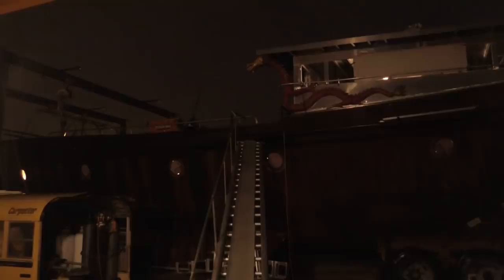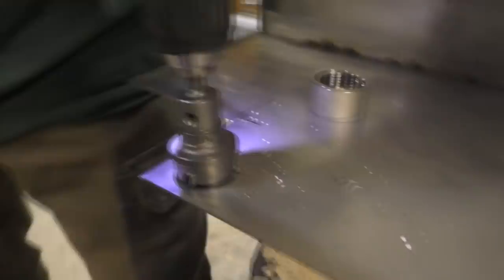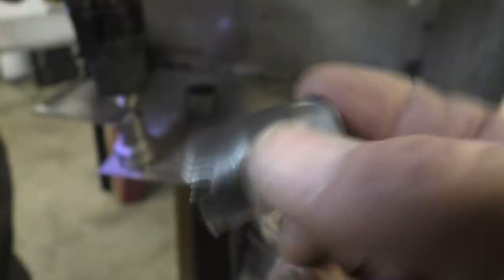I gotta give a huge thanks to Chris - it's been a wonderful learning experience. If you taught me right, we'll see - people on YouTube will let us know. He's got the amperage turned up to 170 with a kick on the foot pedal, nice hot arc, for welding on the stainless expansion tank. What we're going to do is build a recess into the corner of the tank so those fittings will be recessed instead of sticking out.